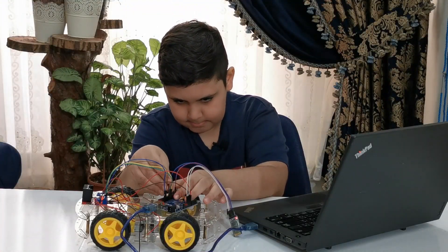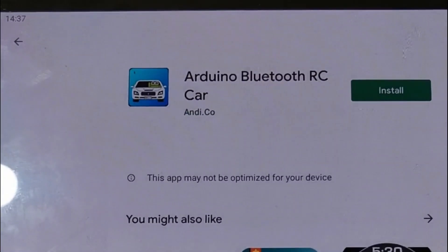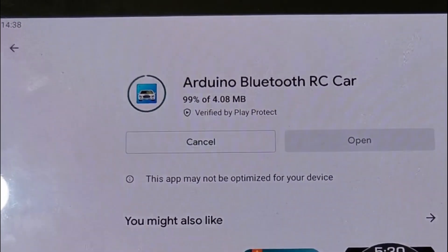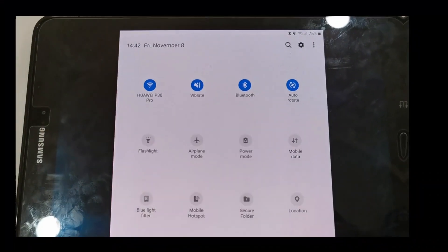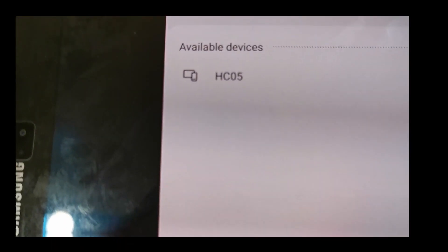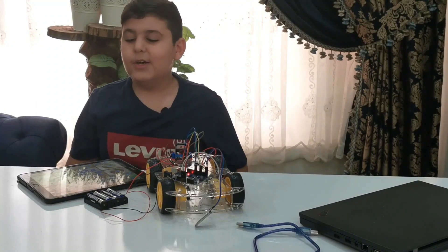Add the RX and TX wires back on, and we're done. You need to install the Bluetooth controller app — it's available on iOS and Android. Install it, click open, click Allow twice. Go to Bluetooth, scan, and if you see HC-05 click on it. Download the profile — the PIN is 1234. The app is open and the code is uploaded!